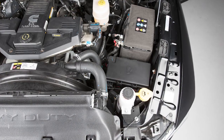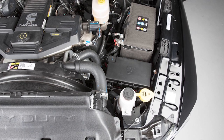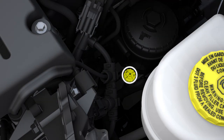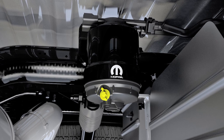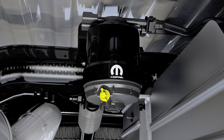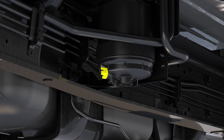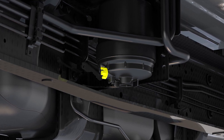There are two fuel filter assemblies. One is located on the driver's side of the engine; the best access to this water drain valve is from under the hood. The second one is on the underbody, located in front of the rear axle above the drive shaft on pickup models. The chassis cab model's second filter location is on the frame behind the front axle.